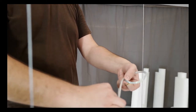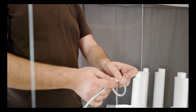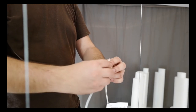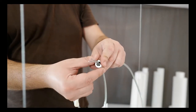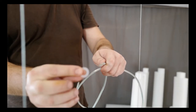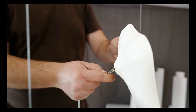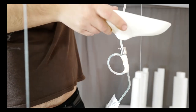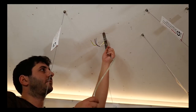Now, at the middle of the main power cable, you must make a small loop and fix it in place with a piece of tape. You must insert the mask nut, the mask nut silicon gasket, and the porcelain sealing mask on the cable and rest them on the loop you just made in the middle of the main power cable. Now you must insert the cable through the opening of the sealing adaptation.